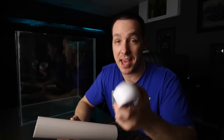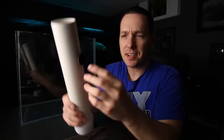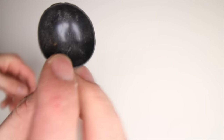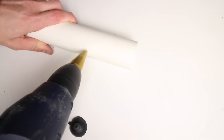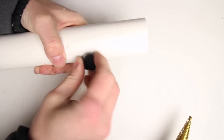You only actually need to do two things. One is get a corresponding end cap and drill as many small holes into it as possible, and then put it on the end of the PVC pipe. You'll then need a small suction cup — the type you'll find on a heater or even a small powerhead that you're not using anymore. The only thing you'll want to look for is that it has a small nub, because we're going to drill a hole in the side of the PVC pipe and use that nub to stick the suction cup in and hold itself in place. That's pretty much it.